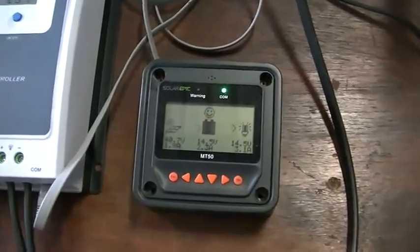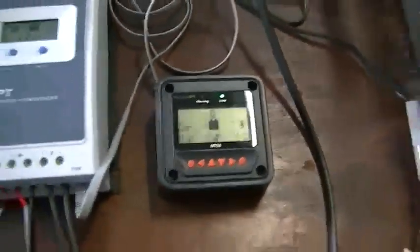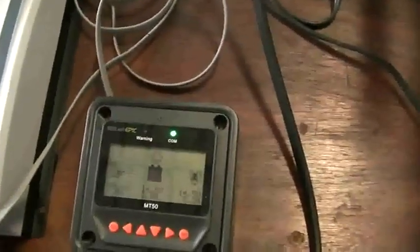It's been 3 hours now. Surprisingly our battery is still full or has filled up. The fridge is only coming on about once every half an hour. It's been raining fairly hard but the sun has just come out in a gap in the clouds and we're starting to see some blue sky. So it really was a bad day for a solar experiment — however, that's a good thing because we now know that 170 watts is more than ample to run this big 80 litre fridge.